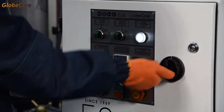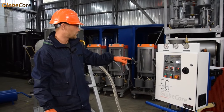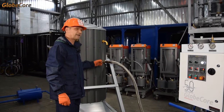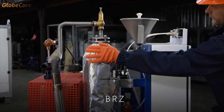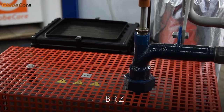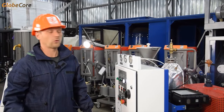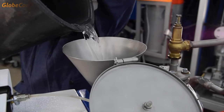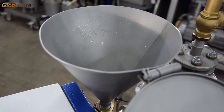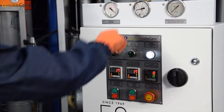Now, let's go back to the machine. It looks modest, but believe me, it's quite capable. Judge for yourself. We can use the machine to purge zeolite equipment with overheated steam from the machine's steam generator. The temperature of the steam is 110 to 130 Celsius. We fill the steam generator with 5 liters of water, then power up the electrodes and wait for pressure buildup.